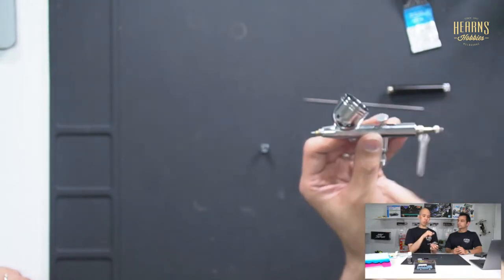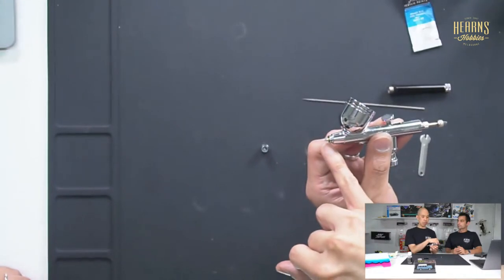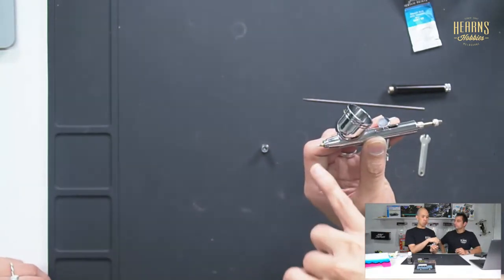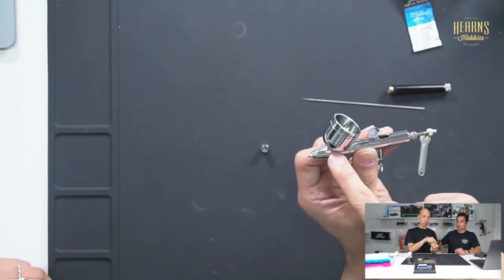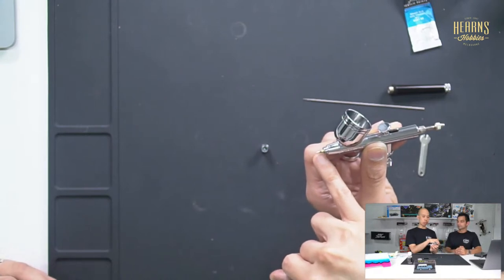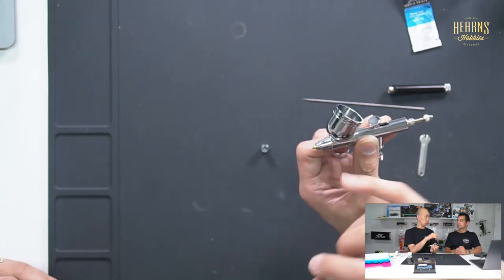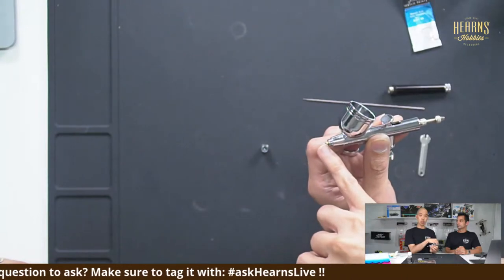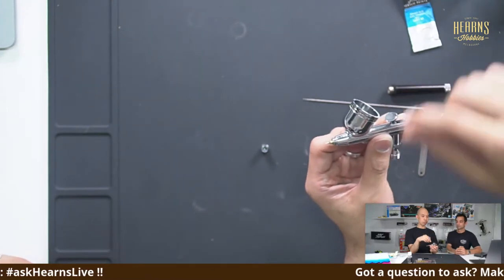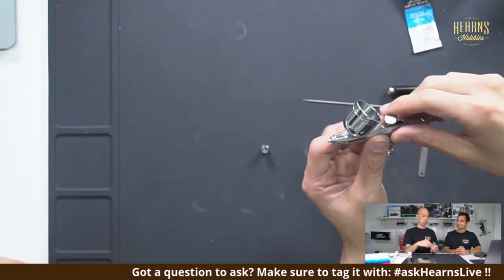Now the other thing you may notice, if you take this off often, is they've got a seal inside, and that seal stops the air from the outside from going in to here. So what you might notice is, if you take off the nozzle and it's clear, and you put it back on, and it's still not spraying properly, it's got air coming back up the cup, it's probably got air leaking through the nozzle and the bodywork. So you need to reseal it with specialist airbrush sealant. Or the simplest thing I've found when you're in a rush, you want to fix things up, is you use the tiniest bit of Vaseline, or even lip balm. So a bit of petroleum jelly, just a little touch on a couple of threads, and when you screw it all up, it'll be airtight.